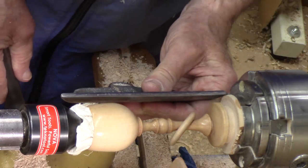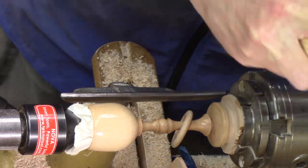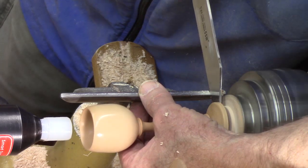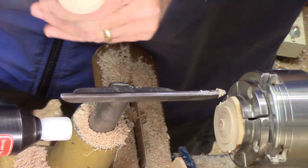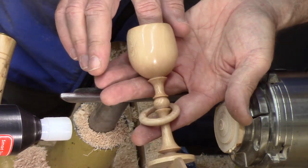I'm going to part this off using a thin fluted parting tool — it makes a really nice cut. I'll brace my underarm under. There we go — that's perfect. I've got a little nub but no torn fiber, so I can cut that off and sand it very easily. I'll sign my name on it. So there we go — a nice tiny little goblet with a bead on it. If you're not a subscriber, please hit the subscribe button and ring the bell so you'll get a notification next time I release a video. Y'all stay safe and come back soon.